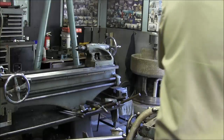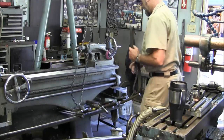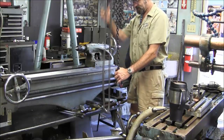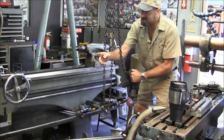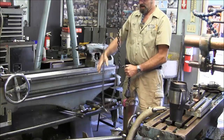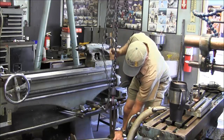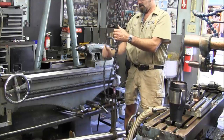Now we're ready to pick it with our gantry — the inside gantry. We've already marked off centerline, which is basically splitting the length of the shaft right in half. We're going to come just a little bit to one side because I want that side a little heavier, so I can bring it forward and set it in.